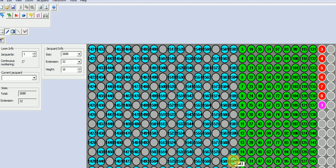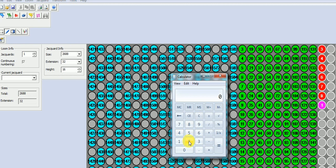So how many ends per inch can I get? One third I am using. One third, it means 84 plus 84 ends per inch for half, and another 400 hooks. How much will we get? You just calculate here. 2400 divided by 168, it comes 14.28. The repeat of this harness is only 14.2 inches, but 1200 divided by 14.2, how much will we get?